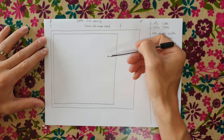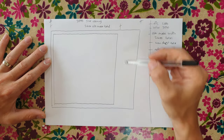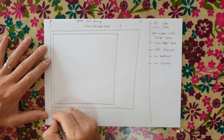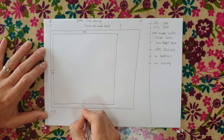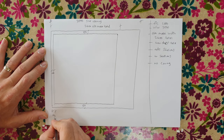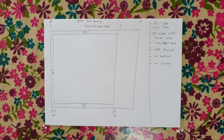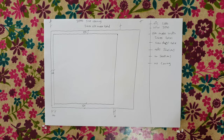We're leaving our usual voids: 40mm on the side, 50mm on the top. This one is open-ended on the other side. We need some kind of panel — I've stopped this carcass short of the overall make line to allow 18mm for a panel. We mark our void: 40mm void, 50mm void top and side, and 40mm at the bottom. In line with the side of the wardrobe we'll have a side panel or cheek on the end.